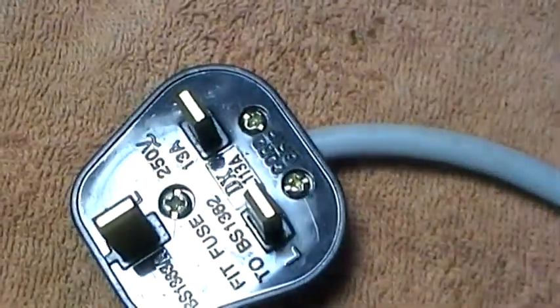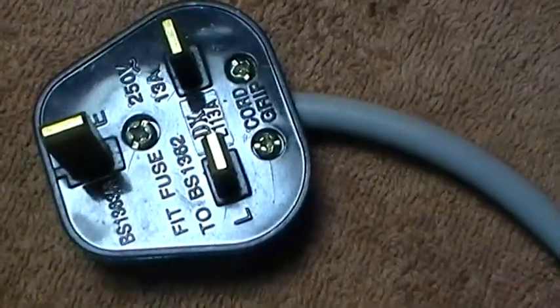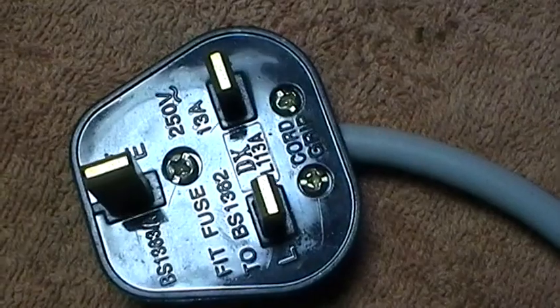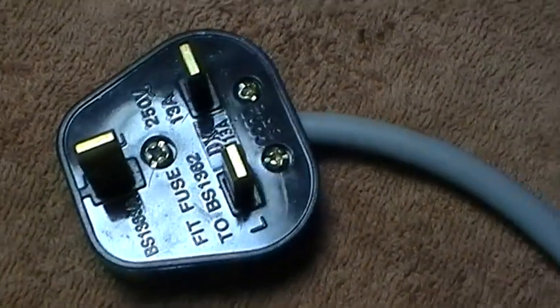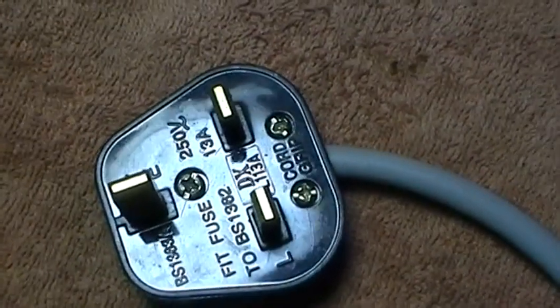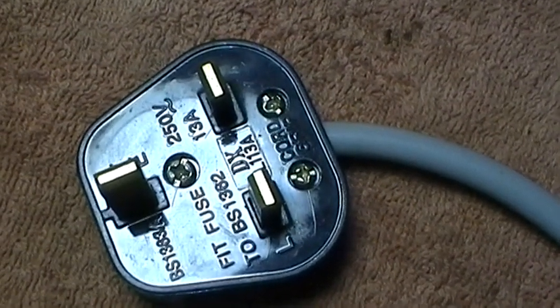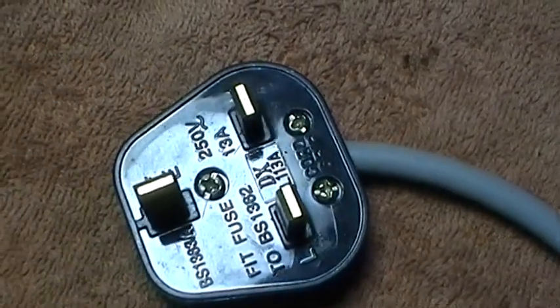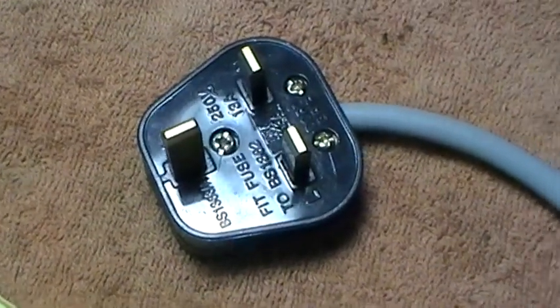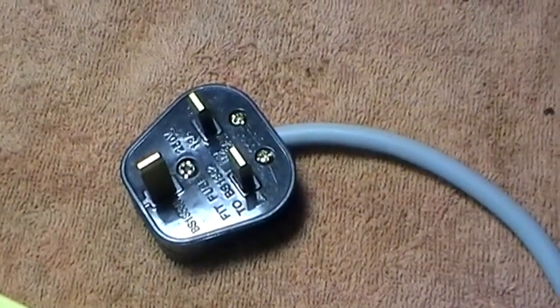The other very important point is that I've actually come across these where the plug looks like a British 13 amp plug, it fits into a 13 amp socket, but it does not have a fuse — it is just straight through, there is not a fuse in sight. There is also not a fuse in the box either. So in theory, you could be plugged into a ring main circuit of 30 amps or even more — completely unprotected. Thanks for watching; any questions, please ask. I'm putting this in partly for interest and partly as a safety warning. Once again, thanks for watching — please subscribe, please comment, please ask questions.